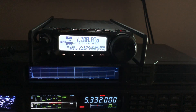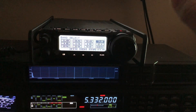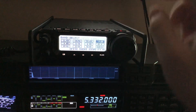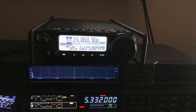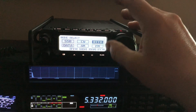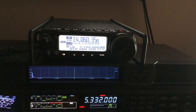A lot of people just start playing with the radio by clicking the band button up here, and you only have a momentary opportunity to do that — click band, rotate the VFO. If I want to go to 20 meters, I'll find 14 MHz and there I am. If I want to change the mode, I hold down the band button and then I can cycle through the various modes. That's how you typically play with the radio out of the box before you've programmed any memories into it.